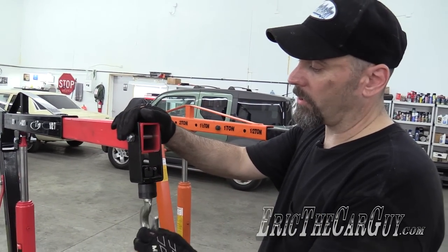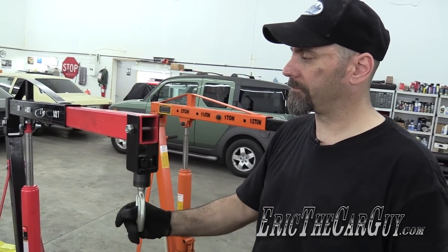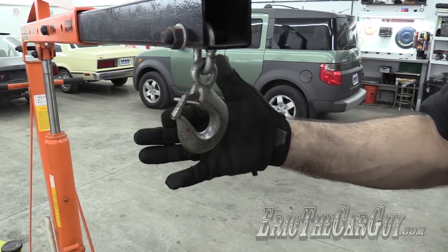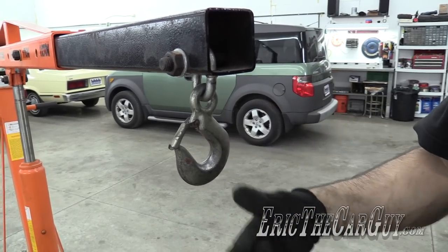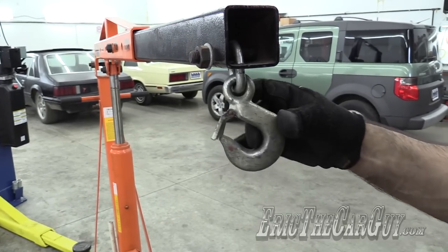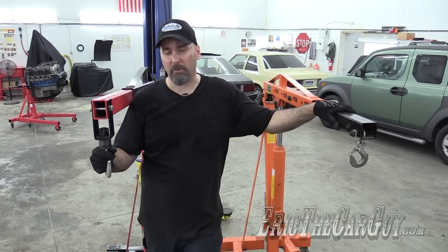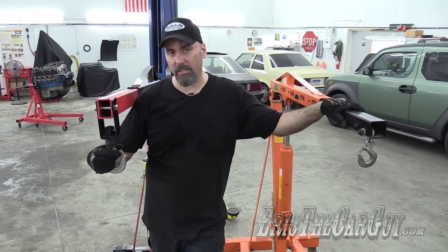The SunX has a unique hook design in that it swivels 360 degrees at its base and swings back and forth. The Harbor Freight, on the other hand, used to have a longer chain — it used to hang down about this far. I cut the chain so that I could increase the height that I could raise things, because as it hung down, that decreased the amount I could raise it by about four inches or more. With this design, you've got a little bit of give and swivel. Initially, I thought there would be advantages because it wouldn't allow things to swing around as much, giving me more control while moving.